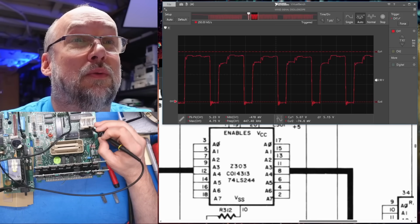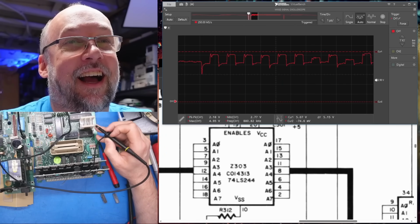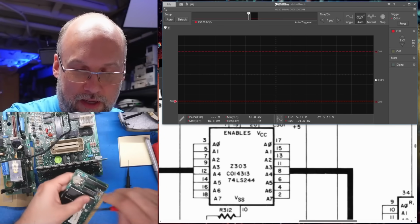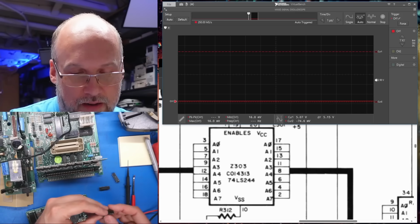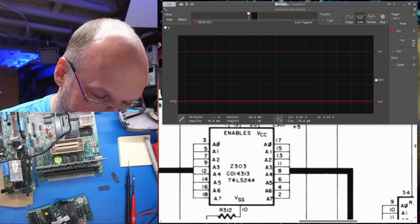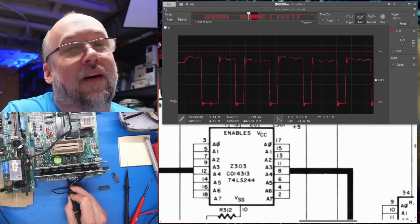It's this one. This was the line. See how there's a little bit of activity up at the top and then it goes down? Red herring. Okay. Just to make sure that I'm not making a mistake, I'm taking out this 244 and I'm going to put the original one back in with the pin back in the board. I just want to make sure that I wasn't mismeasuring, because I'm all upside down when it comes to which chip is where and all that stuff. And conveniently, I have it marked on the PCB where that signal is. No, it's fine.